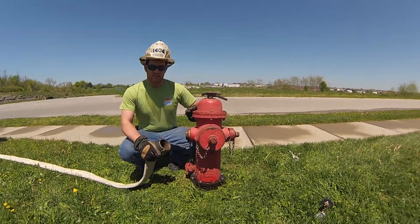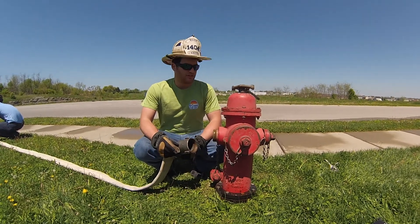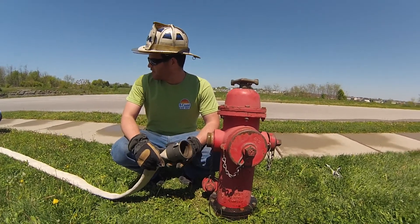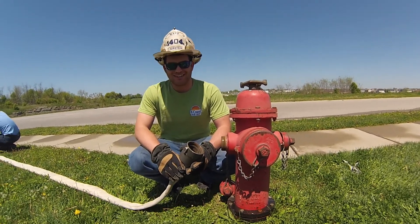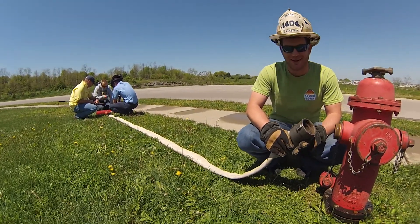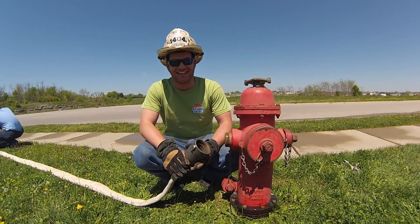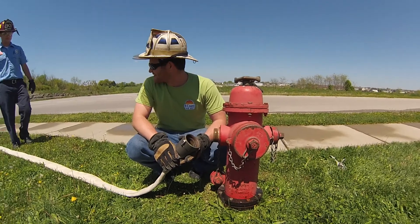Now that we've got the 2.5-inch side outlet off this hydrant, we figured the static and residual pressures from the other side. We've got the hose monster here which also has a pitot reading on it — it says there's 20 pounds of pressure right now, but apparently it's broken because there shouldn't be 20 PSI in the hose at this point. We're going to make it do as best as we can, and with that we're going to cut.